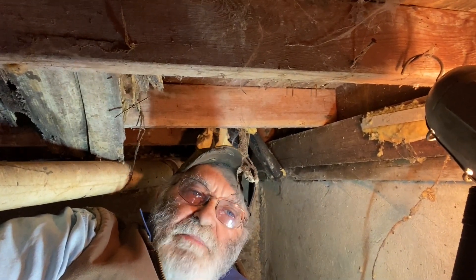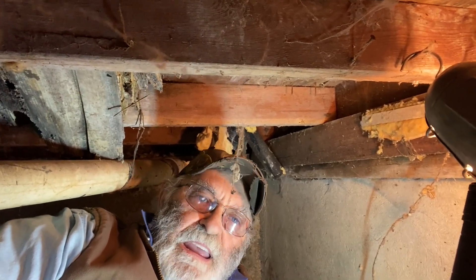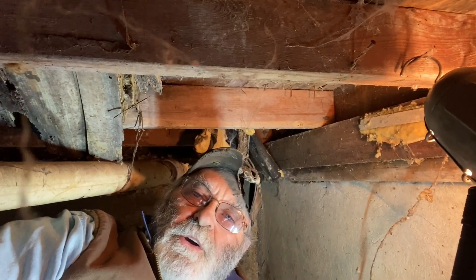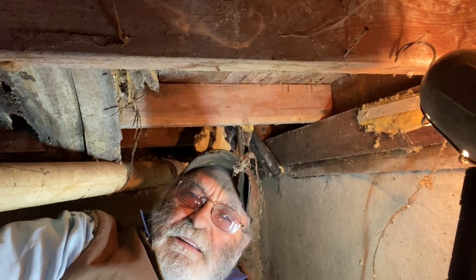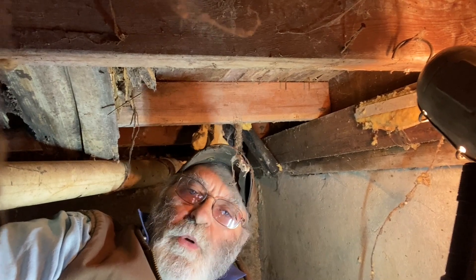She's got a poorly insulated area here in this portion of the crawl space, and I think there's some wind that comes in under and around the foundation. It took its toll when we got down to zero and a little bit below zero. It blew apart two of her water lines. Fortunately, there's some new old stock parts and pieces here, and I might be able to get it patched together with just those.